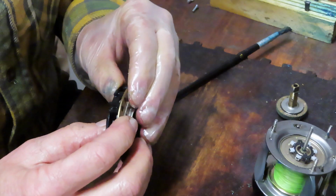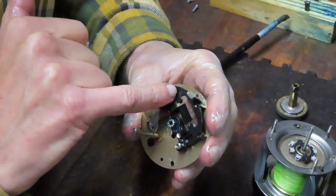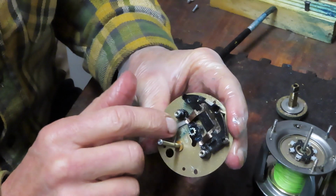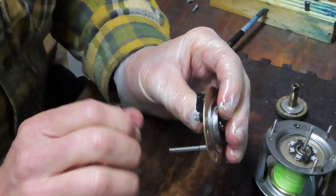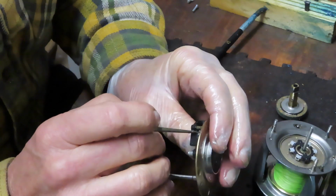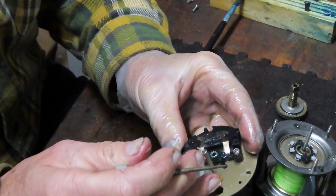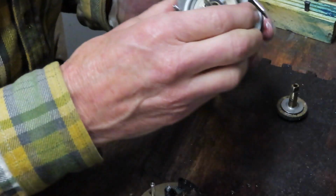There we go. And when you snap it in, that's what you have. Now we'll have the two, there'll be a stud and there'll be a screw coming through here. But that's how you install the yoke spring on top of the yoke, and that's the carrier. And make sure on this side, as I pointed out earlier, that this little return spring has that lever on top of it. It's easy to trap it behind it, it's easier to trap it below. You will not work it that way if that's the case.